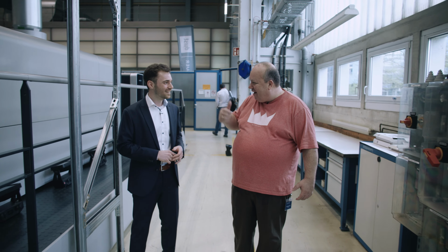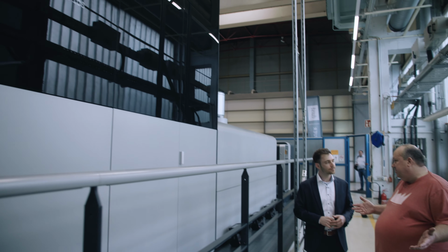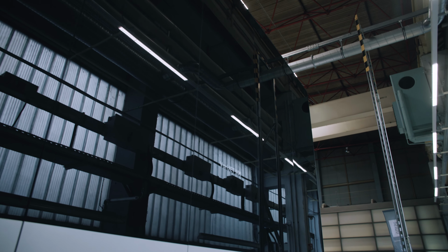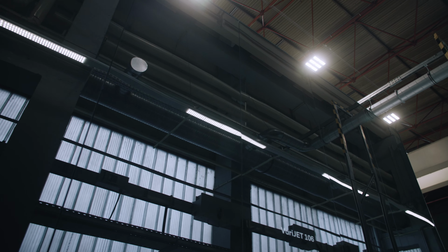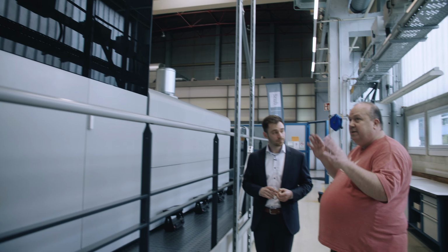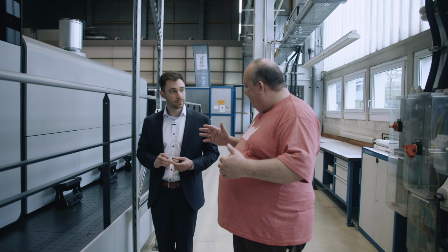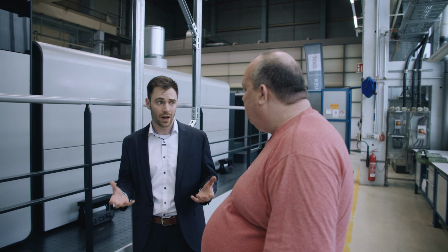Okay, so here we get to something that looks a little bit different from the production machine, because it looks really tall here, right? Mike told me that it is a little bit smaller on the production machine. And the latest ones, yeah. So this is where the printing process takes place. Exactly. Now we have dried everything and it goes into the printing tower. Now we have a new alignment, right? We have our primer dryer, and the primer dryer is also a Rapida part. So we use hot air and infrared technology, also from the Rapida.